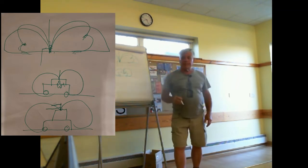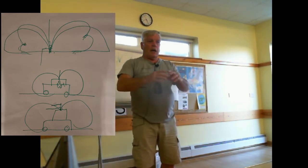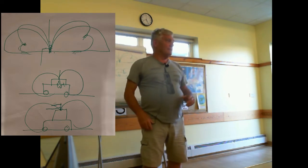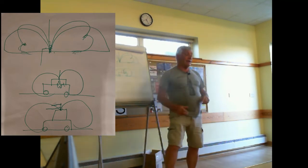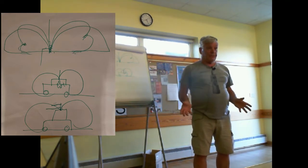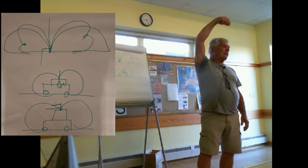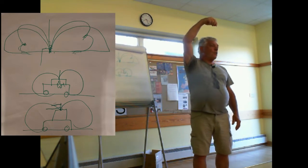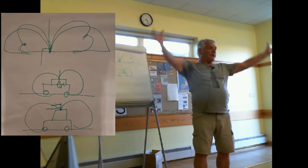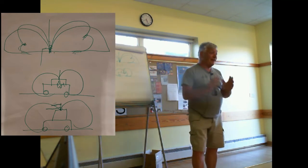Now, one thing you have to remember, I should have brought it with me and I've forgotten, I'm terribly sorry. Right. How many people have heard of a thing called an isotropic radiator? Oh, 1 or 2 of them. Right. It is the standard unit for antenna gain measurement. It is a spot in space that is basically emitting RF in all directions. Basically, if I had a circular balloon, that's what it would look like. That's an isotropic radiator.